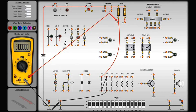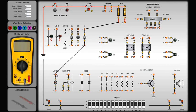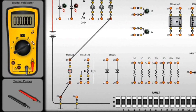To clear all connections and build another circuit, you can click Delete All Wires to remove every wire from the circuit board. Next, we'll set up a series circuit to demonstrate measuring amperage. Current measurements can only be made in a complete powered circuit. As with a traditional DVOM, current is measured by using the DVOM probes as part of the circuit.